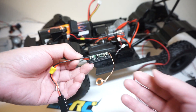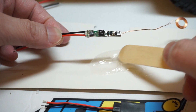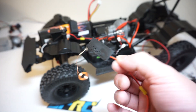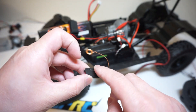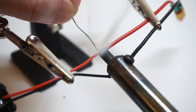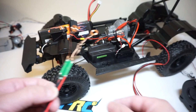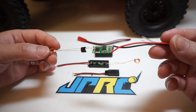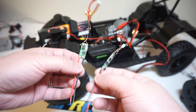These parts did not come looking like this. I have already waterproofed the module by dipping the whole thing into epoxy. I used the ammo can top that comes with your Axial kit, available in your spare parts bag. I put a lot of epoxy in there, waterproofing it and gluing it to the cover so I can tape it with double-sided tape to the underside of the body. I soldered on a Futaba connector — you can use whatever connector you want. You can buy these modules off eBay for about $6, and there's not much work other than soldering a connector and making a housing.